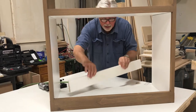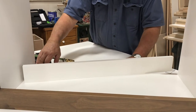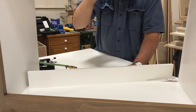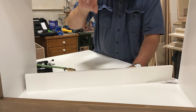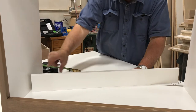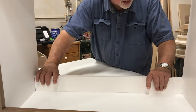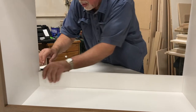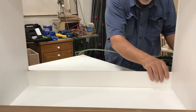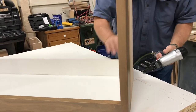First is to put in the hanging cleat. We're only going to put a hanging cleat on the top — remember we're upside down — because we have to cut an opening to allow the plug to come through, and I'm not sure exactly where that plug fits, so I don't want the plug cut right into a hanging cleat. There are cabinets on both sides so this is going to be very secure; we don't need a hanging cleat top and bottom. We anchor this hanging cleat with finished nails from both sides and don't need to worry about nailing in from the outside because we have cabinets on both sides.